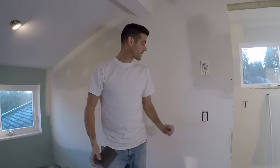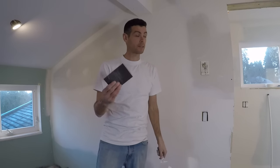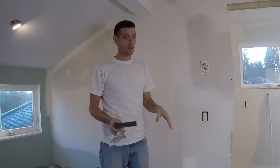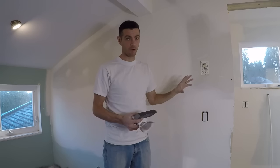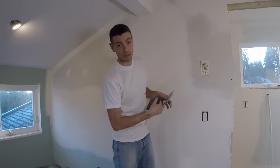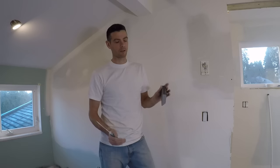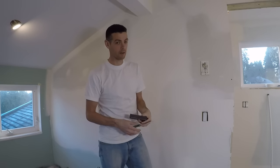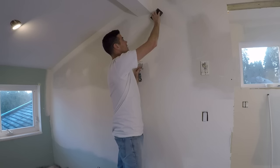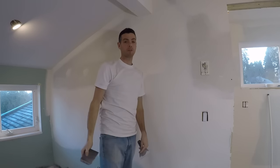As you can see it was a pretty quick sand — there wasn't a lot I needed to do. I usually don't sponge anything at this point, and I also don't sand my corners. Corners should only take one coat over top of tape, so you shouldn't be sanding those until you're finished sanding, otherwise you're going to be scratching them up. However I do find that sometimes I need to detail some things to make sure they're going to coat nicely on the next coat. You can also scrape things away and level it out that way, but it doesn't flatten it out quite as nicely as sanding.